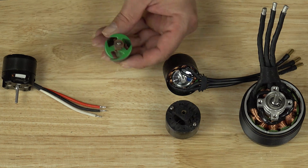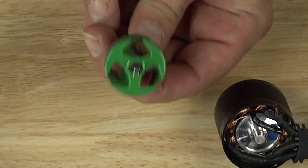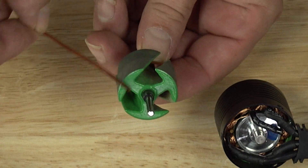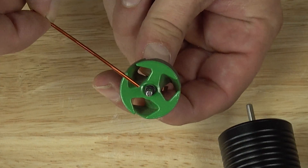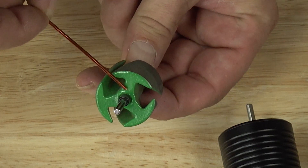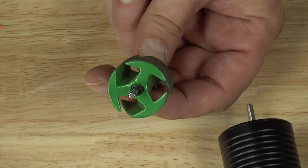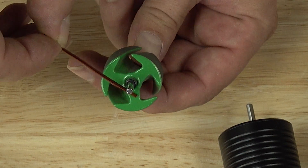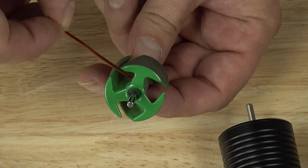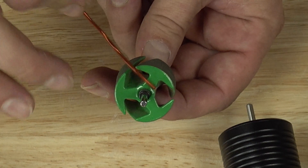This here is a brushed rotor, or an armature. On this, we have coils that are wrapped around these segments. The back iron on this is technically what connects those coils to each other on the back. And since the shaft is made of steel, it does a little bit of work actually. But our laminations, which are insulated here in green, and only what's behind the coils in this little center section would technically be the back iron.